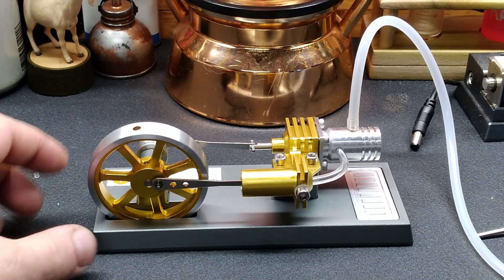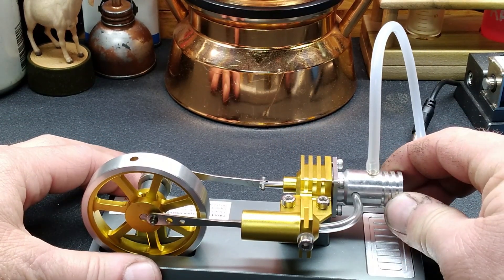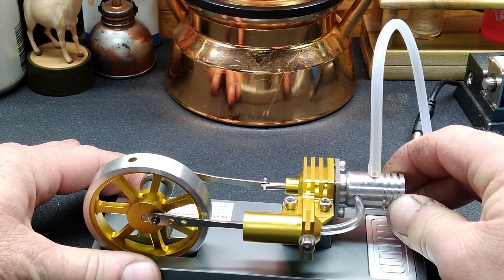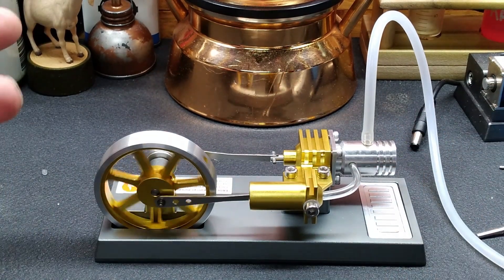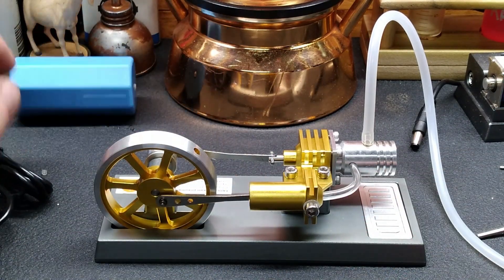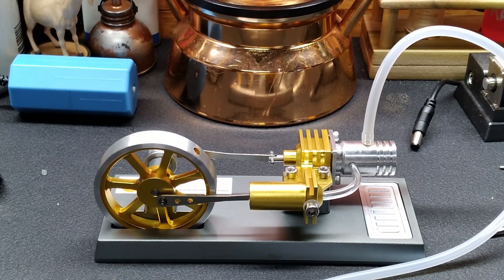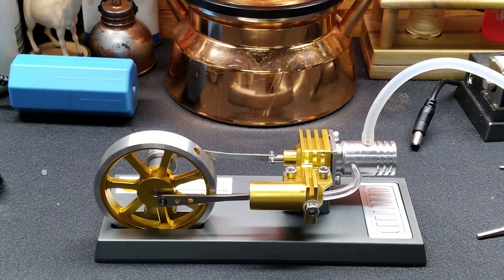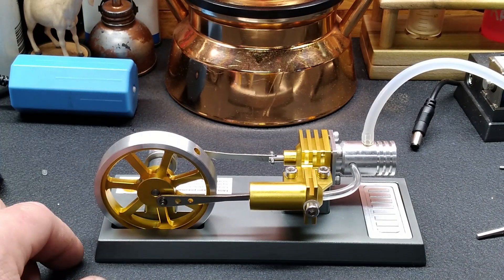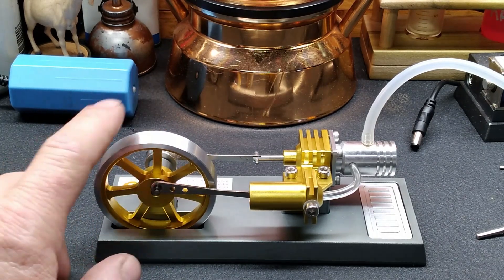After setting the timing I realized that this cylinder up here in the front, where our valve is - yeah, it can be moved in and out. So that can also help to set timing. Let me get that other air compressor hooked up and put our little aquarium pump out of the way. I'll take our line and hook it up - I'll try to make it as quiet as I can but you guys are going to hear it run. Hopefully that compressor isn't too loud but we've got four pounds at it now. Let me open the valve.